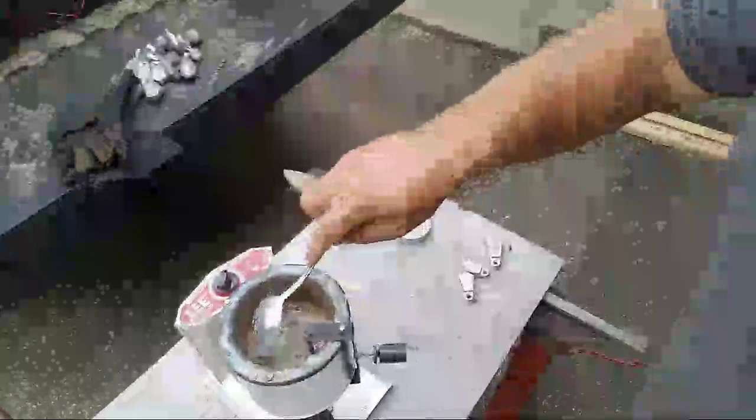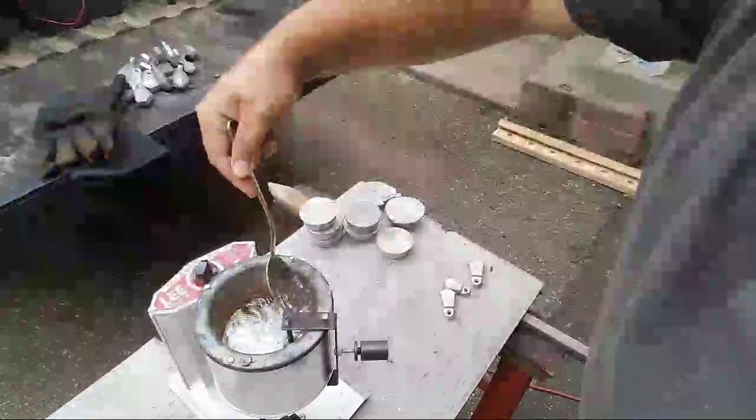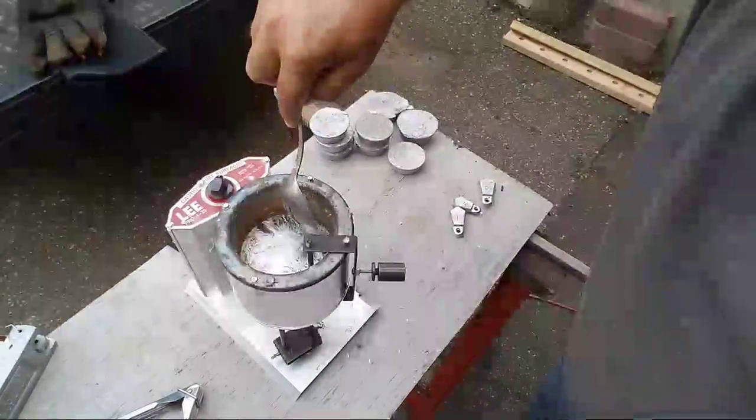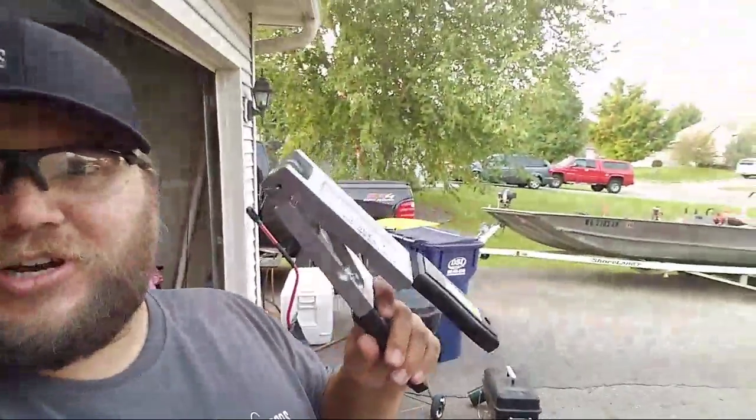I need to skim this — I'll show you guys what I mean. I'm just skimming here. You can see it's not clean — it should look like a mirror when you're looking at your lead. Here's the sludge, I just put it right on the table and tap it on there. If the lead does get too hot it'll start to change color and turn gold. If you start getting weights that break off at the tag when you pull them from the mold, your mold is too hot.